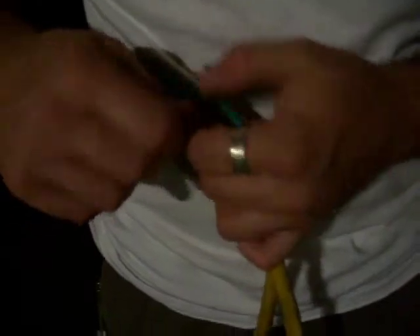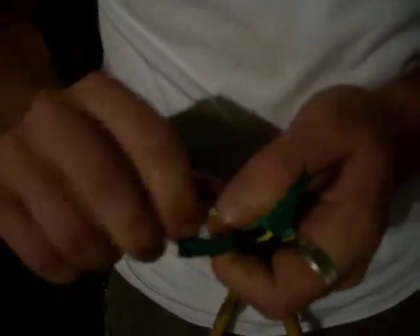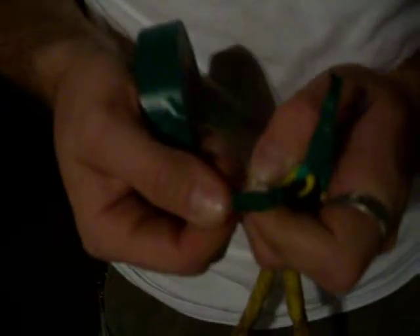And then white wires. Normally, you want to do this with wire nuts instead of electrical tape, but since we don't have any, we use e-tape. One thing you want to watch for — there are bare spots. As you can see, right there, there's a bare spot. You do not want any bare spots, so be sure to check that over. You want to be very thorough and efficient when you do this.